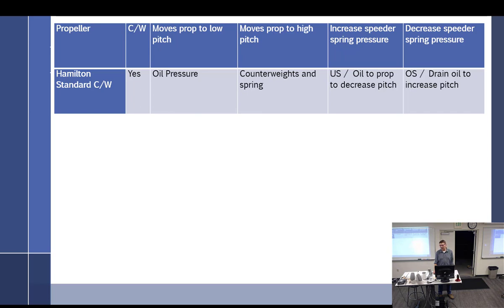If you set the governor pressure too high, you can cause damage; too low, and you get a prop that doesn't work. So it is always constant. That pressure is roughly 150 to 300 PSI.